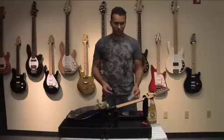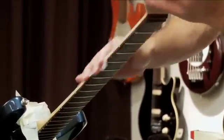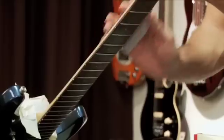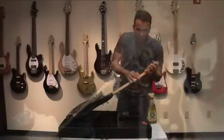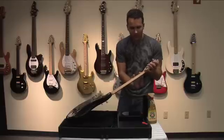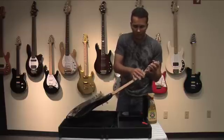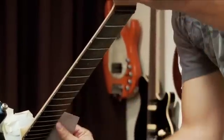Now that the neck's taped up, we're going to start with some six hundred grit, which is the coarser of the two grits, and sand the neck down, making sure to sand along the grain. Be very careful — try to stick to the back of the neck. There's no real reason to sand into the fretboard. Around the headstock, you're going to want to be very gentle and careful as to not get into the headstock wood, as it's not necessary to really sand that down. On the heel side, you're going to do the same thing.